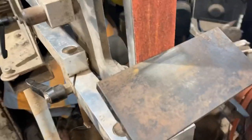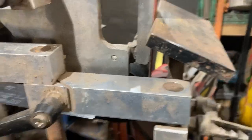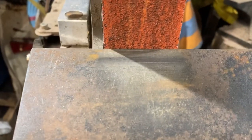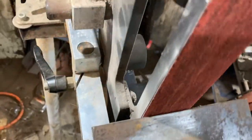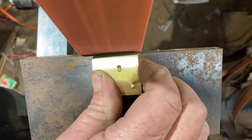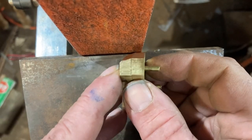I'll change over to this angled tool rest for doing the bevel on the front edge. There's an arm to adjust it, but I've pretty much set the angle where I like my bevel on the front edge to be and I just leave it there. You can see there's a big gap at the top, touching at the bottom — and that'll cut our angle on. There's the angle.